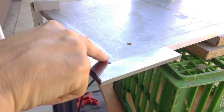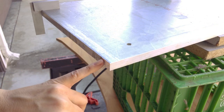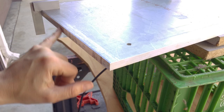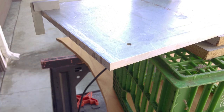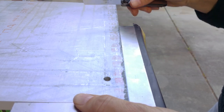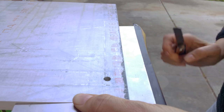I think by the time I straighten this out it should be a little bit better. I'm okay with this. I haven't taken much off of this edge here, but I've been pretty much sanding this a lot. I'm going to touch it up a little more and see if the angle changes. I have my little steel square and this is a 0.25 millimeter feeler gauge - it won't fit under there, so I'm pretty happy with this.